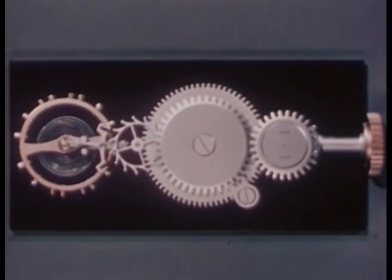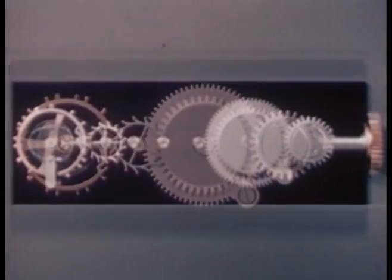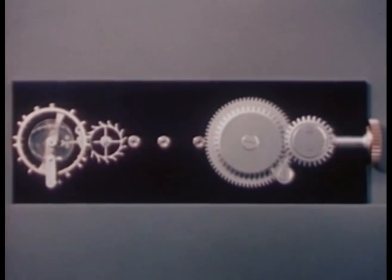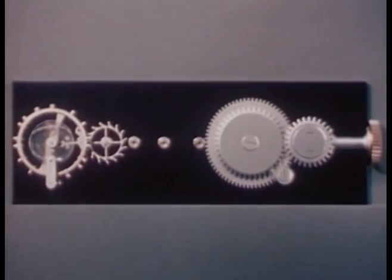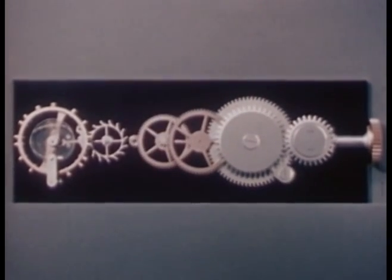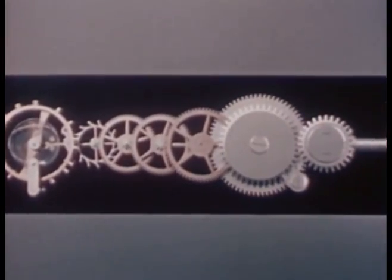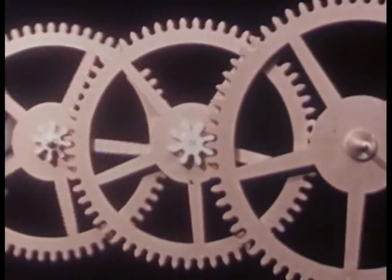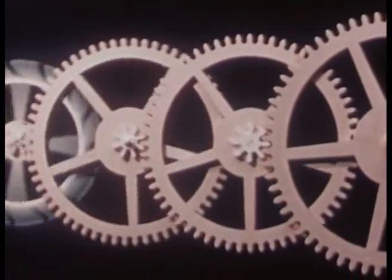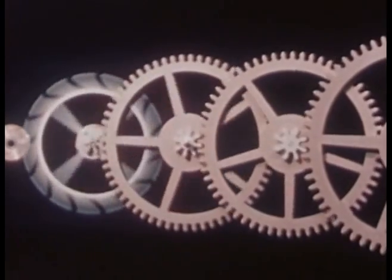What we need is a way to stretch the power so it will last for more than a day. In our water clock, we used a hose to transmit power from the faucet to the nozzle. We also need a way to transmit power here. So, let's add a system of gears and wheels. We'll stretch them out in a line instead of in their usual closely confined location in a watch. As a result, a few turns of the mainspring barrel, driven by the mainspring, will drive the escape wheel many, many revolutions, enough to last a full day and longer.